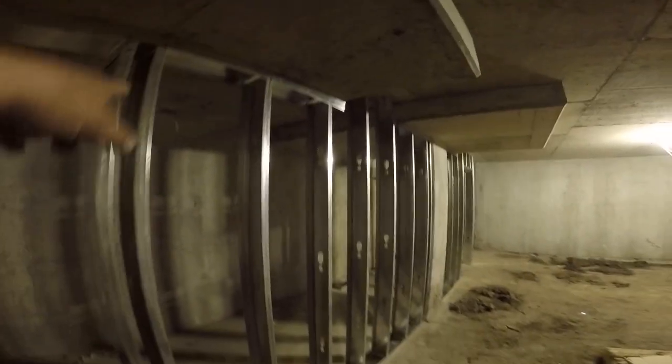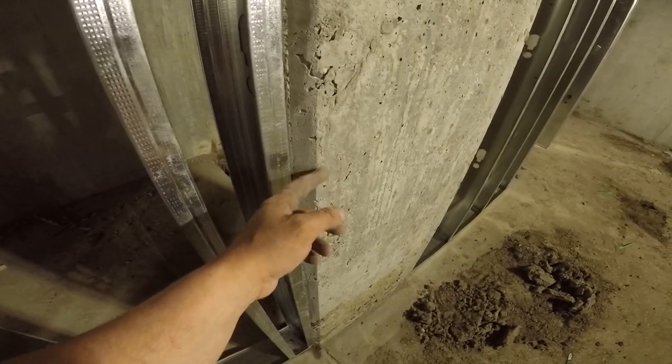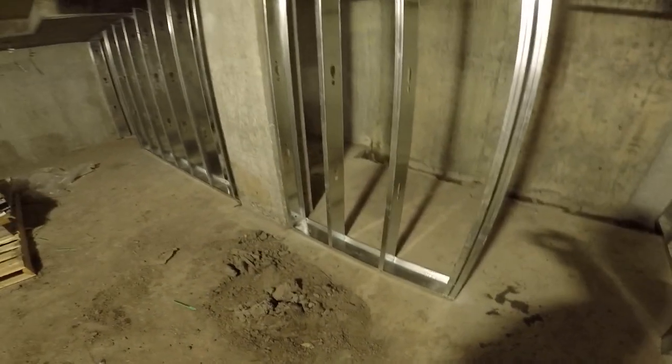It's hard to use the framing tool on the tops like this, but along the bottom is good. See here, there's no room for studs but I just put the track there — that's where the header goes, and it's perfectly level. So all the studs are plumb, and you can see how it finishes when I'm doing the layout — it finishes five eighths behind the wall here, so the board finishes flush. That's how I did my layout, squared it out, simple as that.